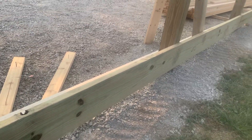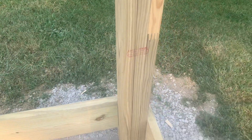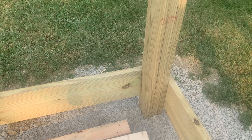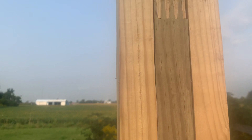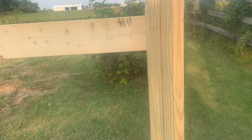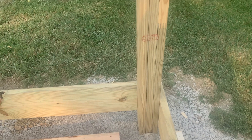You can see we're using three-ply laminated columns. These are a popular choice given the cost structure. Very rarely do we use a four-by-six; occasionally we use a six-by-six on smaller buildings in the 20-foot width range. But on a 32 by 48, the beauty of a three-ply laminated column — three two-by-six yellow pine pieces glued and laminated together — you can see it's finger-jointed with pressure points throughout. It's 30 percent stronger than a six-by-six, and unlike a six-by-six which is a solid piece of a tree and will naturally twist, this stays truer and straighter. Something to consider when you get your quotes.